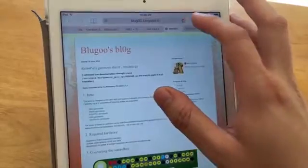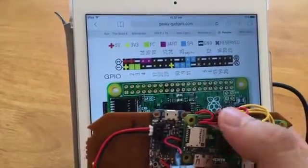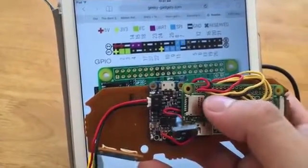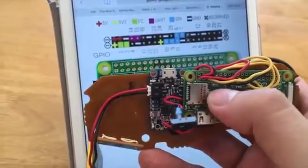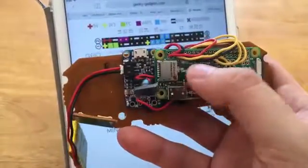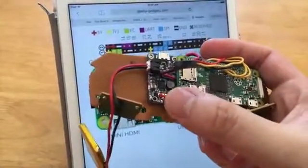Using a GPIO pin reference for the Pi: power maps to the 3.3V pin, data maps to the pin just underneath, ground uses a different ground pin since the first is already used by the PowerBoost. Clock and latch map to pins 10 and 11. I'll put a full wiring diagram in the description. Once you have those wired, the soldering is straightforward: pull the pins through, strip them, solder them down, clip the excess, and repeat on the Pi side.